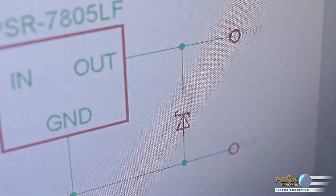A disadvantage of the choke converter, or switching regulator, is that if defective, it itself offers no protection for the connected devices. For example, if the switching regulator is destroyed due to a high input voltage and a short circuit is formed internally between the input and the output, this voltage is applied to the connected devices, which can lead to possible destruction of the board. A remedy can be achieved by inserting a fuse — a melting fuse, PTC fuse, or polyfuse — in front of the plus input of the switching regulator and, in addition, by connecting a transient voltage suppression (TVS) diode between plus output and common minus connection.